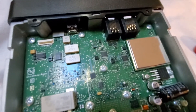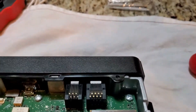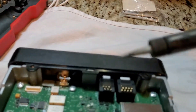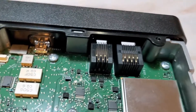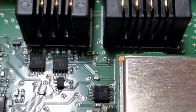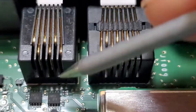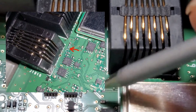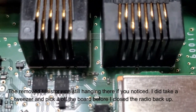I'm a little nervous about doing this because I can't find where it's been done before on the internet. I have taken my soldering iron here and took the tip — the finest tip I could get. I got it hot, made sure it was flowing solder, and I basically just put it on that. You can see down here that resistor is gone next to this one right here. I applied a little heat to it and just a little pressure, and it pops right off.